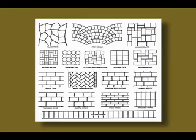Disposable paper stencils are utilized to impart the pattern. They mask off the underlying surface and leave behind realistic-looking mortar joints. A dry shake color hardener is applied to the exposed concrete before the stencil is removed. The result is the appearance of individual stones or bricks that have been mortared together.